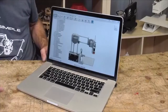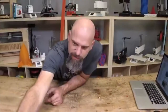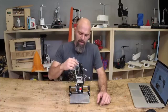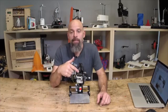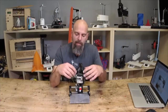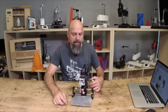And finally, the Adopt-A-Bot. Right now I want you to see this cute little guy — this is the Adopt-A-Bot model. I'll publish the files. Those of you that download, understand that we are printing on a 0.5 millimeter tip with 0.5 layer heights on our fast setup when we're prototyping. We're going to recommend a 0.4 tip and 0.2 layer height so it'll look really pretty. We want to make sure the holes are good in the drawing for everybody.